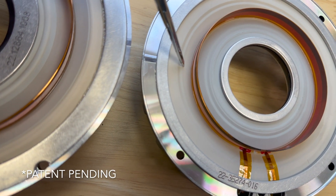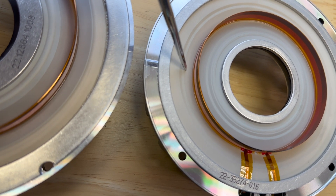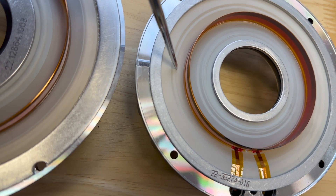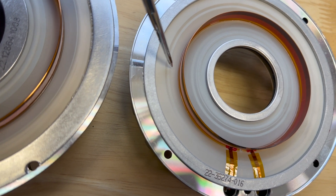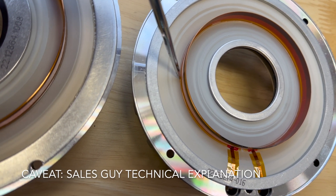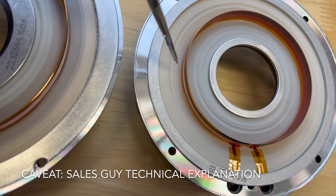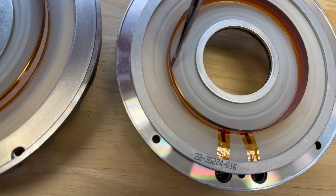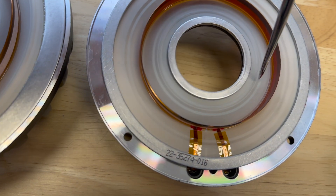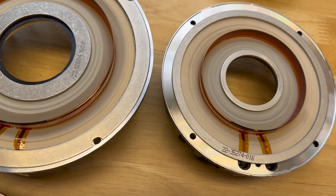On the 354 — and this is the subject of the patent — there's the coil diaphragm. This little bump is not the surround; it is a ledge. This is the surround here, and that ledge lets the 354 diaphragm act bigger at low frequencies. Then when it gets to high frequencies, just this inner portion of the diaphragm works, and this part gets kind of decoupled so that it behaves like a smaller diaphragm than it actually is. It's asymmetrical, so the inside works a little bit differently because it's got a narrower diameter to work with versus the outside, to get the widest bandwidth practical out of this driver.